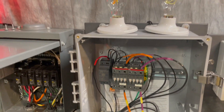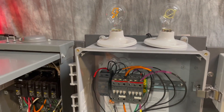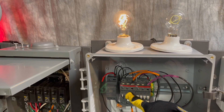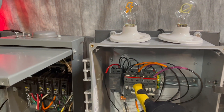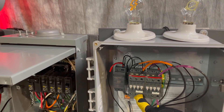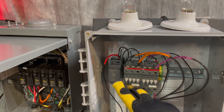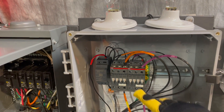I'm going to show you that the connected loads are in fact controlled by these contactors. If I push down on this contactor, that's my first circuit. I have two contactors so I can control a single 240-volt circuit — with line one in here and line two in here, and line one out and line two out. That's a single 240-volt circuit. Now if I have two 120-volt circuits, I could use this terminal in here, in here, out here, out here — and that would be two separate 120-volt circuits controlled in a pair.